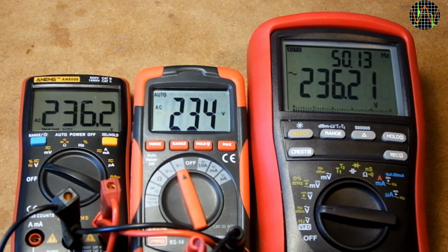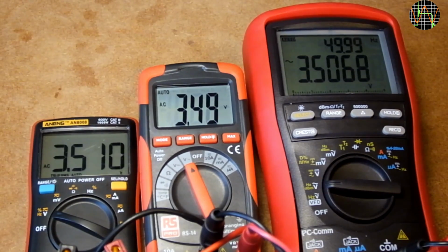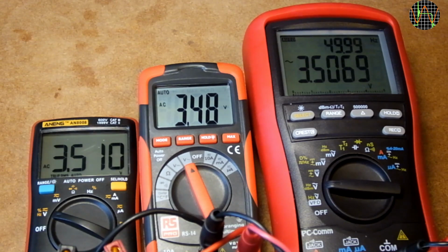In industrial estates with lots of high power motors or when measuring power converters, AC waveforms are no longer nicely sinusoidal and things will be different, as we shall see in part 2. For now, let's keep AC limited to sine waveforms. Instead of the form, we can of course change the frequency, although the meter is specified only for 50-60 Hz.